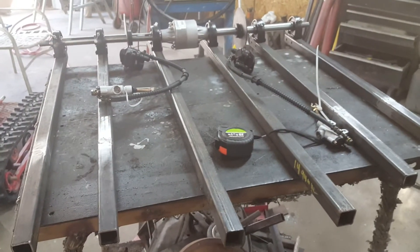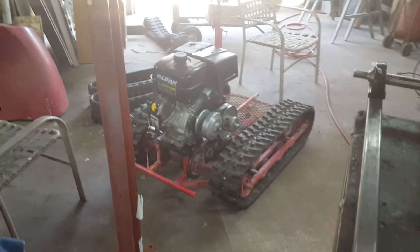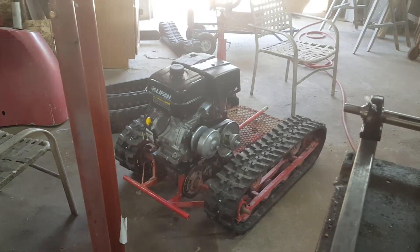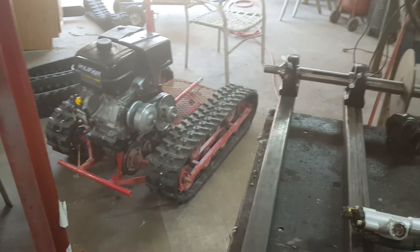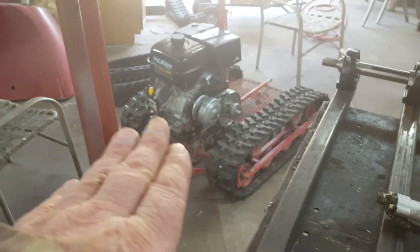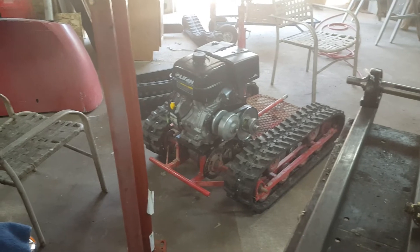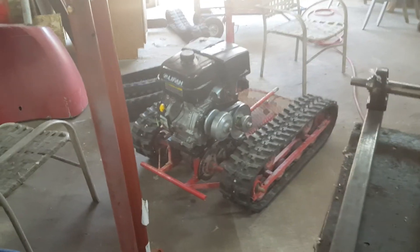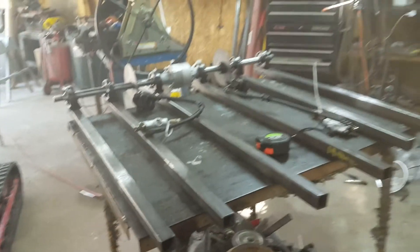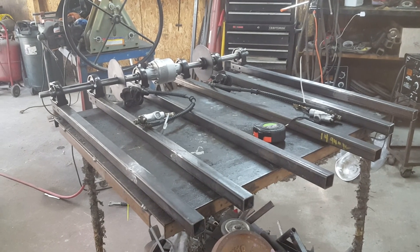I'm really enjoying the current vehicle with the 13-horse engine rather than the 6-and-a-half-horse. That motor is going to come off and go on this new build. It was a fun test and it runs really good. Something I didn't mention in the other video — I did take the governor out of that engine. If you saw me run up and down the road, that's why. I haven't rejetted the carb or touched the exhaust — just pulled the governor. It's easier to take the governor out of the 13-horse than the little 6-and-a-half-horse. Hey, thanks for watching — we'll catch you another time, have a great spring and summer, God bless, bye!